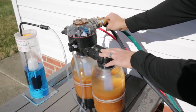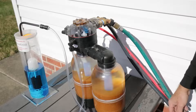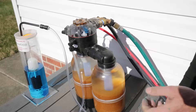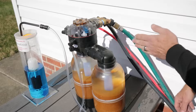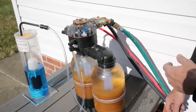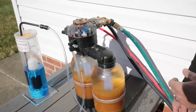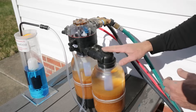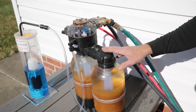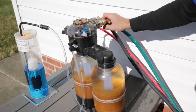Most units are accurate down to about 0.25 to 0.3 gallons per minute, but trickle flow is still a problem no matter what. Even at a quarter gallon a minute, if it sneaks by the meter that's almost 400 gallons a day of capacity that you lose — like having eight extra people in your house you didn't know about. Trickles, leaky toilet flappers, leaky toilet overflows — those are all bad. But that's the Kinetico twin-tank in a quick nutshell. Thank you very much.